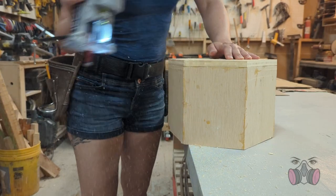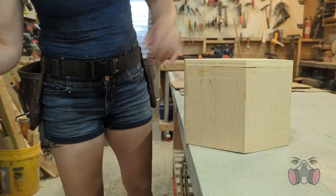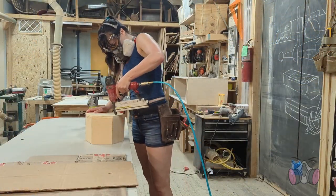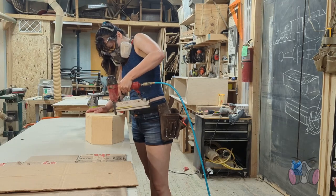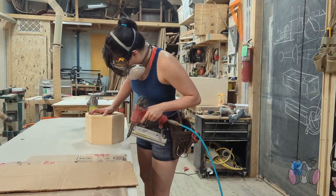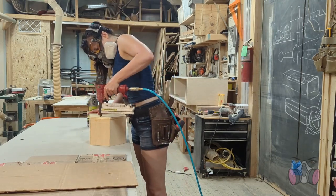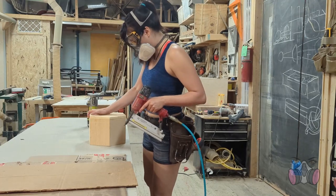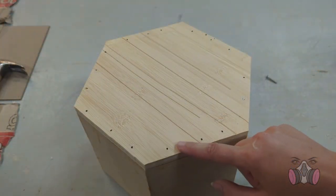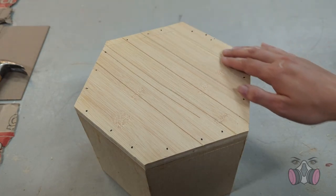Okay, back to the show. After it was dry, I used my handheld router and went around all of the sides, cutting off the parts that were sticking out. I ended up deciding to add a few nails to the back too, just in case. In hindsight, I should have done this from the get-go, because then I wouldn't have had to use clamps. Now, to add the little spines to the joints.